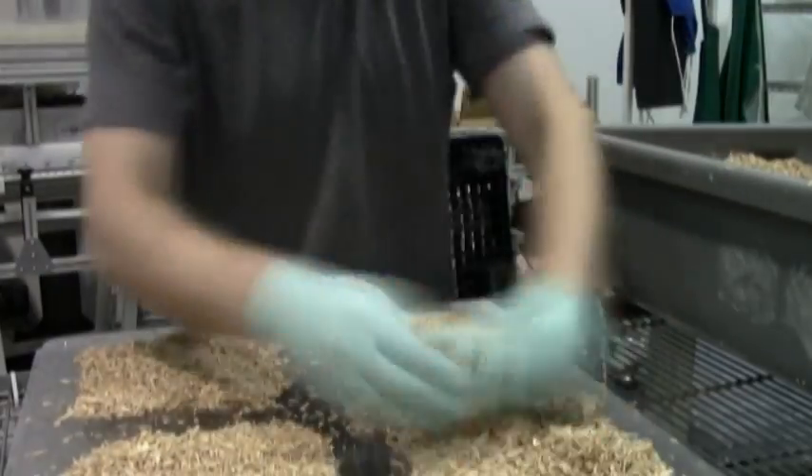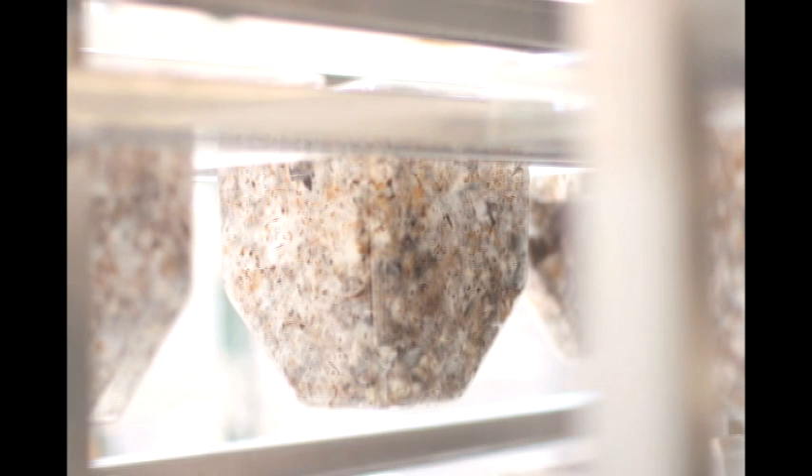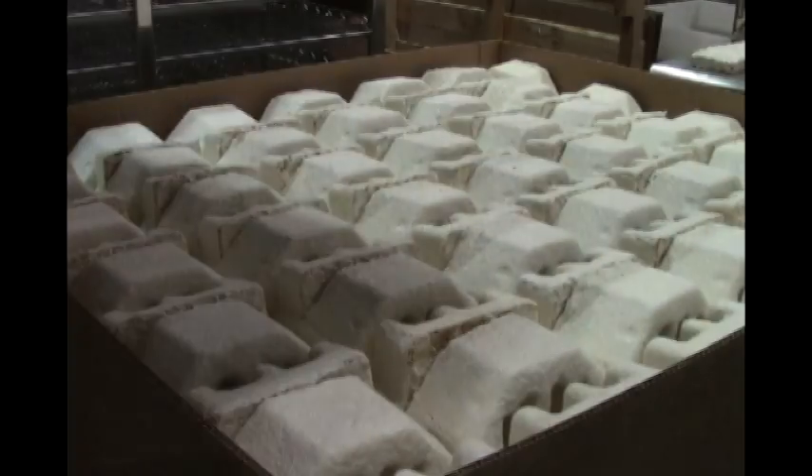We refer to this formed matrix as a mushroom material. In a few days, the newly grown mushroom material is broken up by a trommel. This broken up material is packed and sealed into thermal form molds. The material is allowed to grow, self-assembling into a solid mass which takes on the shape of its cavity. After we finish growing our parts, which takes just a couple of days, these parts are popped out of their molds and put into a heated environment to stop growth and dry the parts.